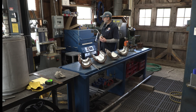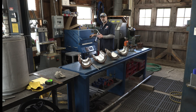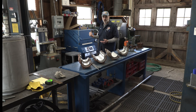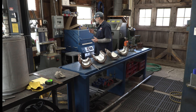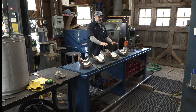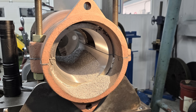This has been a real fun project and I also enjoyed using my new oven. We've got many more projects that we're going to be playing with. I can't wait to start working with investment castings — we're going to be melting out wax and other materials that we have for printing shapes and then casting them right here in the shop. Everything worked fine. It really made a big difference on pouring Babbitt to have the housing at the optimum temperature for the pour.